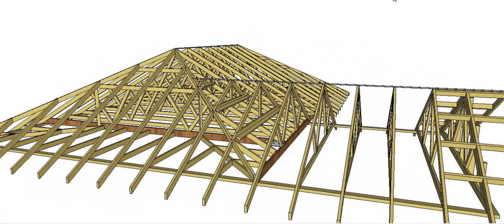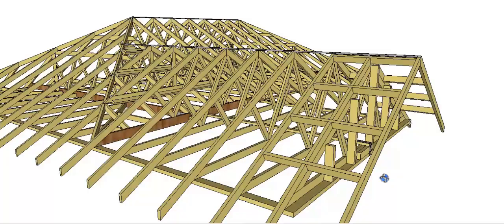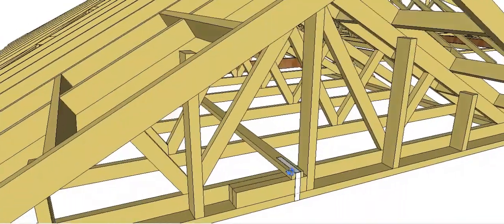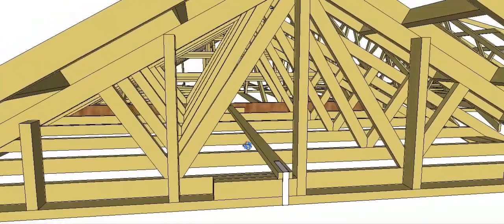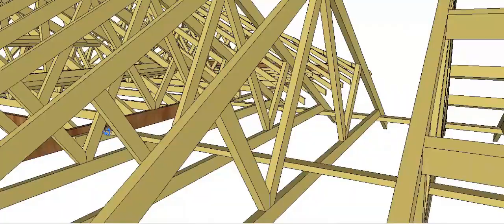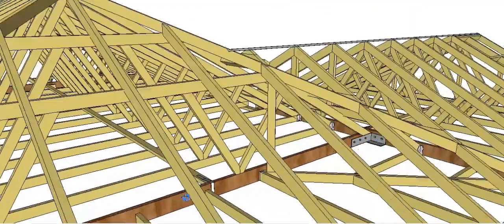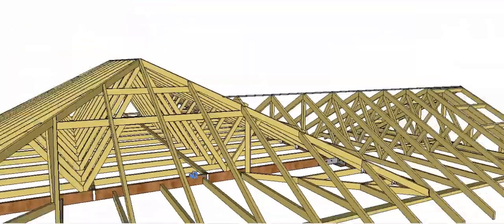So that's all our trusses in place — now comes the long part: tying them all together. They've all got to be triple gripped or tied down with one or two triple grips, or a cyclone tie, depending on what your tie-down requirements are. You'll have to put your longitudinal braces in — timber in there, packed and strapped so that they don't move. This will all be required depending on what your truss manufacturer has specified — how many you need and where.